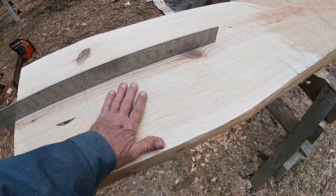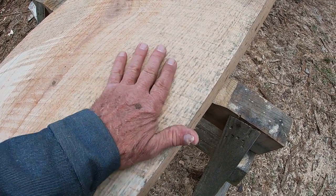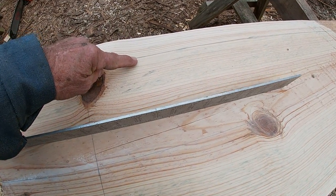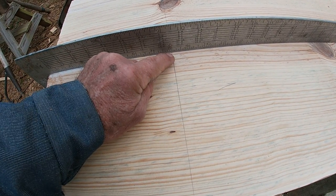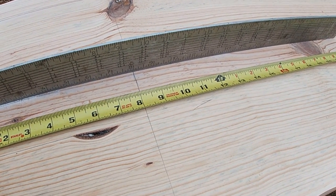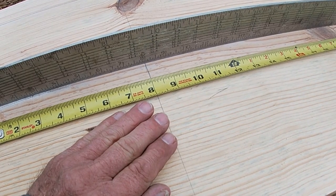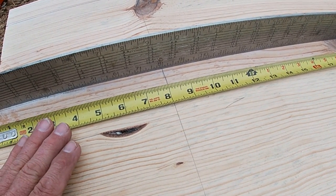The log is now flipped over. I planed it with my power planer — I like a smooth surface rather than the circular saw texture. I put my square right on the center line and I've already snapped the center line on the outside just like I did on the inside. I also snapped the line for the bottom rip on the outside. I've got my shoulder mark at eight inches and I can pull my tape from that to the other end to get my mark for the inside shoulder, which will also be eight inches back from the end. You always want to do your layout on both sides pulling from the same end of the log.